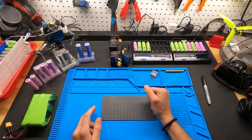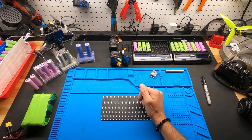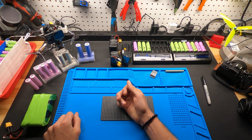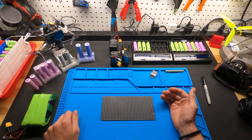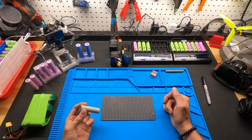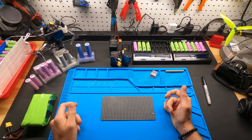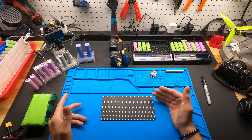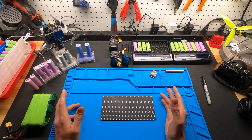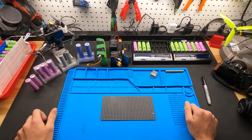It's best to invest in quality cells. I'm grading cells here — figuring out the internal resistance so I can pair them up. Most importantly, you need to check the capacity; if it's too low you don't want to use it. It's also good to grade the cells you buy to make sure they're not lying about capacity or amperage. If you put crappy cells together, you'll get a crappy battery, and there's always the risk of it malfunctioning and losing your quad.